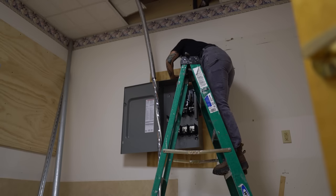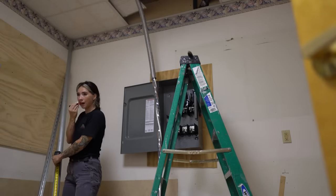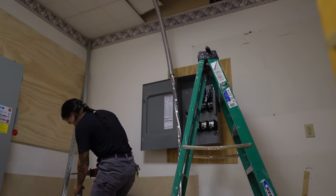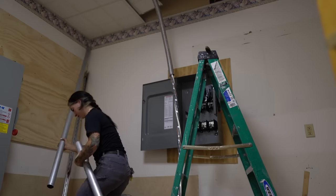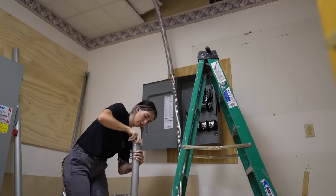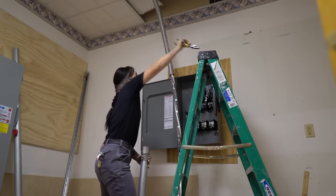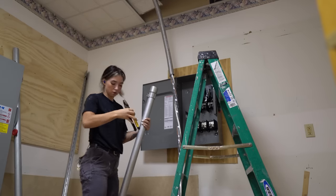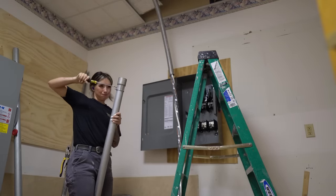Now that I knocked it out and put the connector in, let's see how I'm going to get this piece of pipe with this MC up into this panel without breaking my back. Realistically you can come down with just the MC, which I did do on the load side of this, but I'm not going to do it here because there is way too much exposed wall. I don't feel comfortable just dropping MC down — I think it'll look bad — so that's why I'm putting a piece of pipe here.